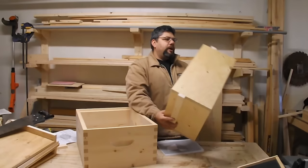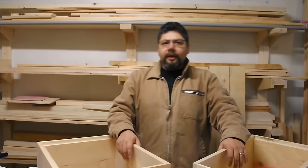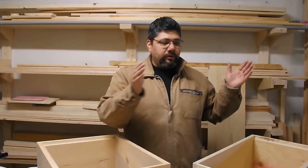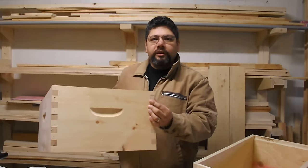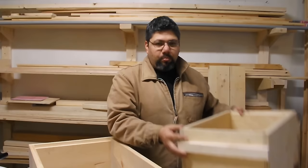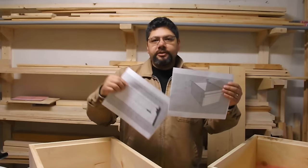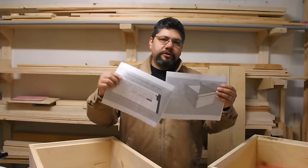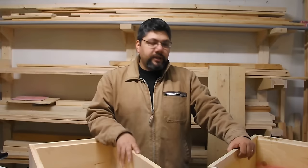I'll show you a few little tricks to make these work, and how you can build them with just a saw. Building a beehive isn't actually as hard as you may think it is. I used to think it was crazy — numbers flying all over at you, you don't know the inside, the outside, the width, the length, how many this, how many that. I'm going to simplify this for you. Make it so that this hive doesn't require all the dovetails and the cuts and the fancy pieces. It's made out of cheap plywood, butt joints, and you can actually build it with a saw. I've got plans in the description below and on my website where I have a small blog. Revert to the sizes on there, because from time to time I call five-eighths, seven-eighths, and it's better if you just go off those plans. We're going to get started — you're going to see how easy it is to actually build a beehive.